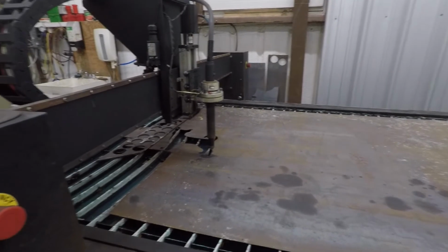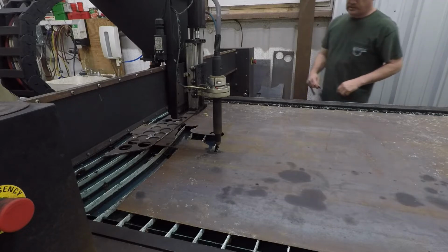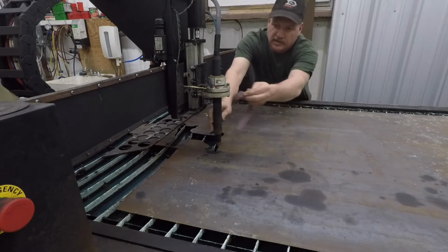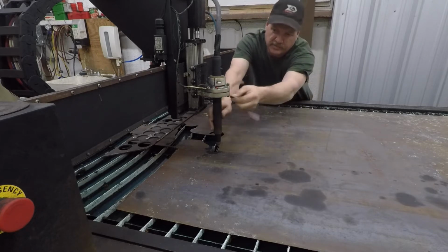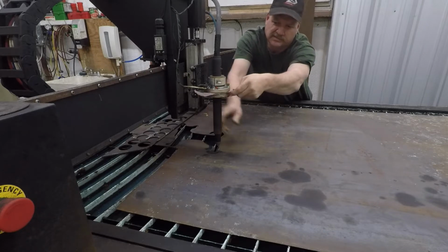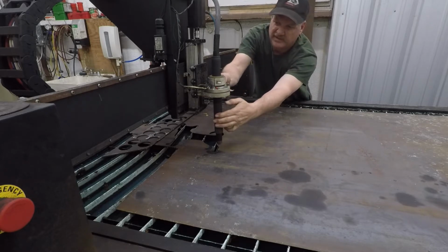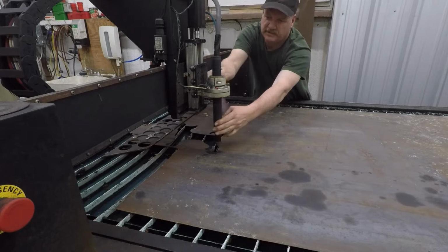what you're going to have to do pretty often. I really need to take it apart probably and just clean it. It's probably kind of crusty in there. What you can try to do, there's 3 contacts where these wires are going through there, so just take some little sandpaper and just drag it through there both directions, the top and the bottom of the contacts in there. Just kind of drag it through there. Do that on all 3 of them. And usually it'll take care of it. It'll take just a few minutes to do that.